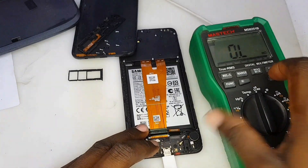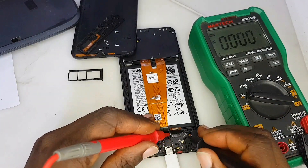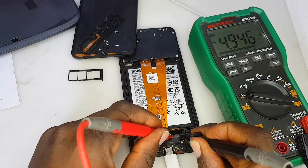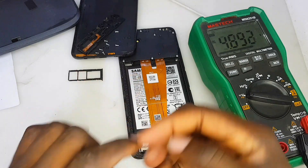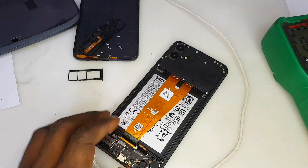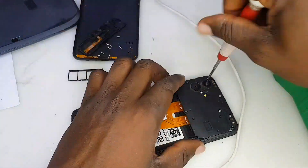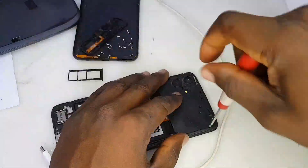After cleaning, you need to take some readings. Be familiar with your multimeter — make sure you know how to use it. We're going to take a reading of the voltage from the charging system to this port. We have four volts, which is perfect. That means charge is getting in from that side. Now we are going to open the upper side of the board.